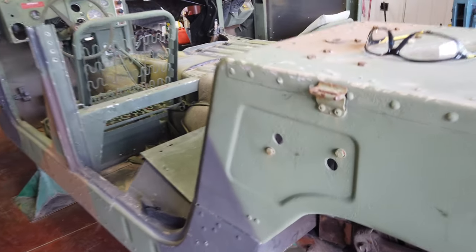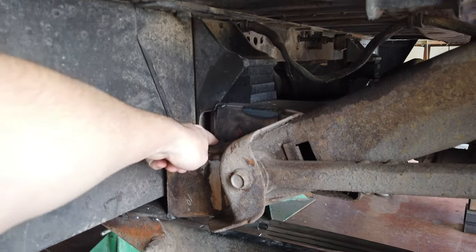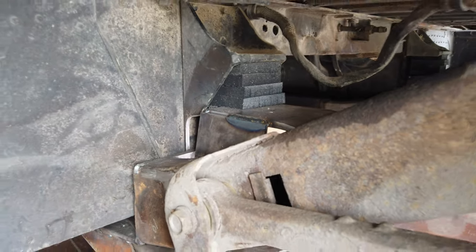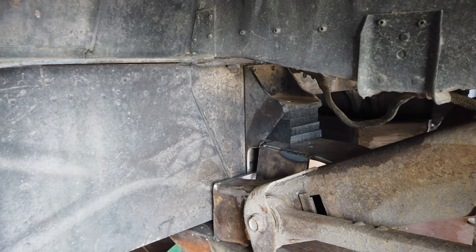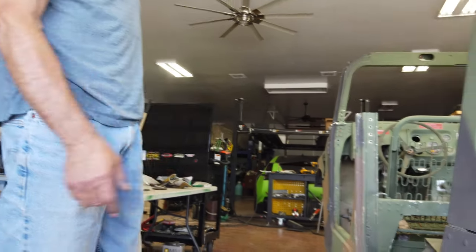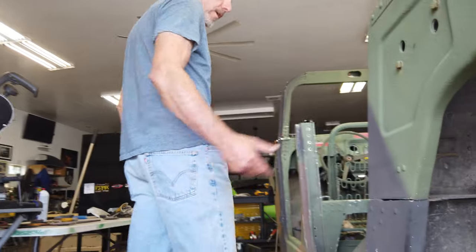This thing's going to be pretty wild — it's pretty wide. He ended up working on a mount there that he still needs to finish. Got the main body mount that comes up, and he'll finish welding all this in and probably put that gusset like we talked about before. That's got to add quite a bit of strength right there. A lot of it needs to be finished welding. Once I take the body off for that, he also wants to do some sort of little rubber mount between the body and frame so it's not solid-mounted, because it'll just tear up the aluminum riding down the road. I'm using horse mat — like they put in horse trailers. I went and got that and cut it up. It makes awesome trays for the bottom of batteries, body mounts, just anything to take out some of the vibration. It's still pretty stiff so it holds its shape.